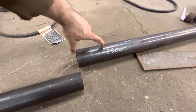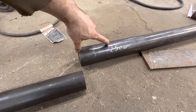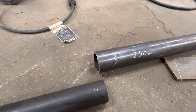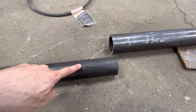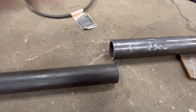So I gotta cut these pieces four inches, and I need eight of them. I gotta take them to get turned down on the inside a little bit because I can't find that size pipe anywhere. And I really want this to just be replaceable — not have to get it machined every time. I'd rather machine this piece so I can just replace that every time.